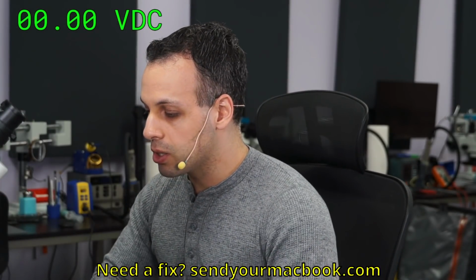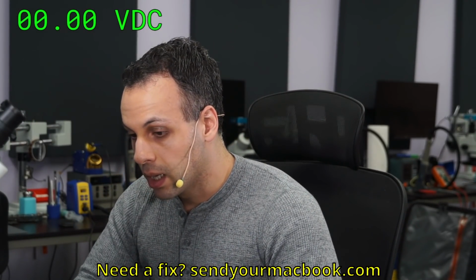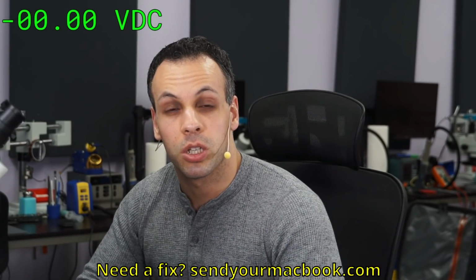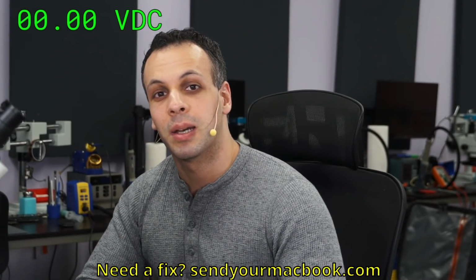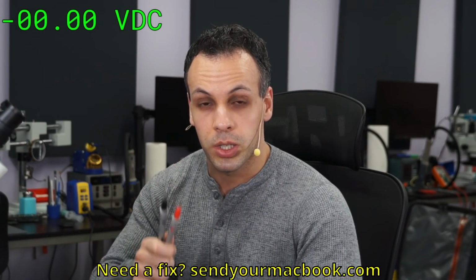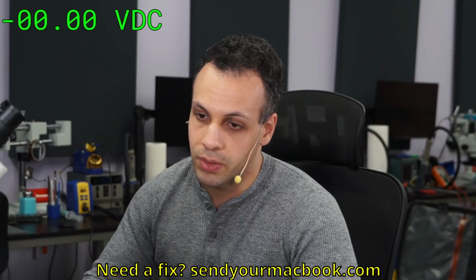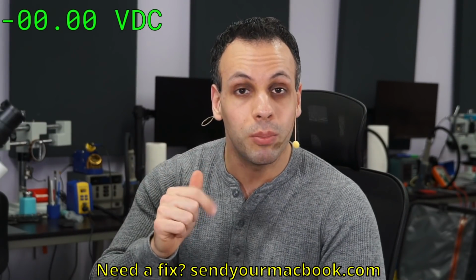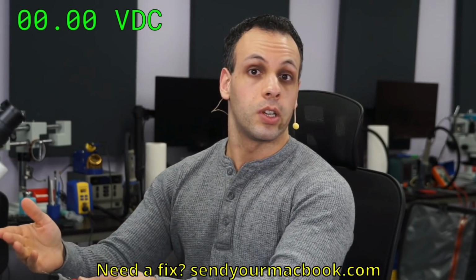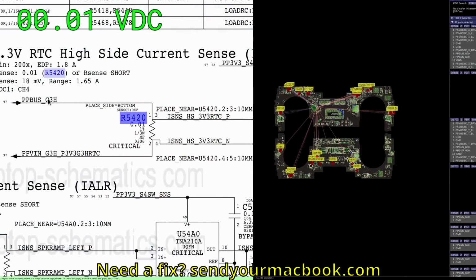On the 2018-19 model machines, PP3V3_G3H does not come first with PPBUS_G3H second. PPBUS_G3H comes first, and then PP3V3_G3H_RTC comes second. See that? Sequence is very important. So if you only watched older videos on the A1707, A1706 and A1708, you just learned something, because usually PP bus is not the rail that comes first. But in 2018, it is. Different design. Things change.